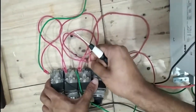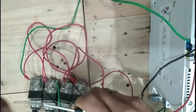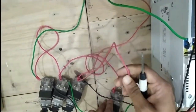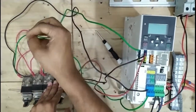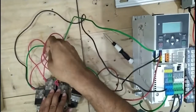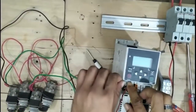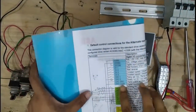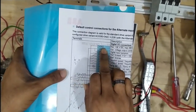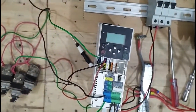So friends, we confirmed every switch is directly connected. The short terminal is going to the second part of the switch and then to the 24-volt side. Our connection is fulfilled: DI1, DI2, DI3, and DI4 short terminals are all going to 24V. We are clear on all the digital input connection systems.